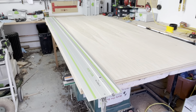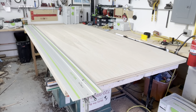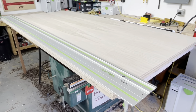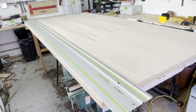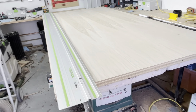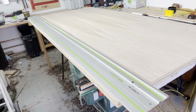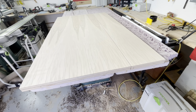Next step is to cut the rough dimensions for the plywood and make sure any edges we're planning to glue up onto the hardwood are nice and flush and ready to be jointed. I'm going to do two sheets at a time, which saves time. One of the advantages of using a track saw is that you're not pushing an 80-plus pound piece of plywood — you're moving a five-pound saw on a track. If you do this kind of work and don't have one, I highly suggest it.